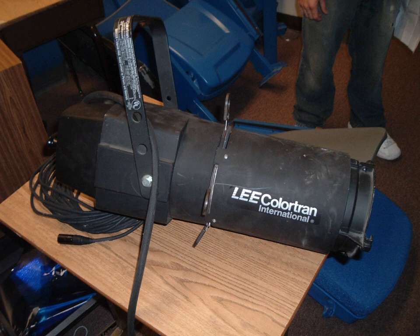The design of the Warp allows the standard trunnion arms to be replaced with a motorized yoke. This yoke links also into the ring controls, providing automation of all other functions: focus and zoom, shutter insertion, rotation and gobo rotation. The motorized unit is without any forced ventilation, fans, and completely silent, making the unit ideal for acoustic critical applications, TV studios, concert halls et al.